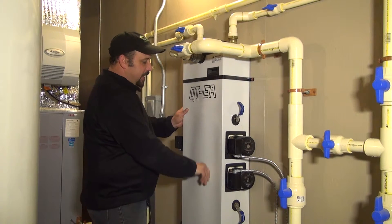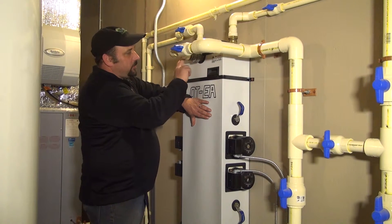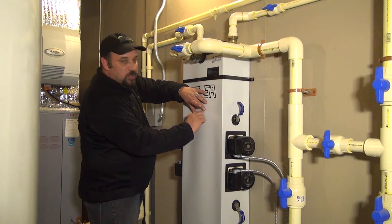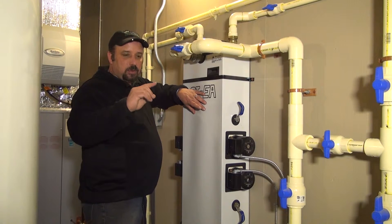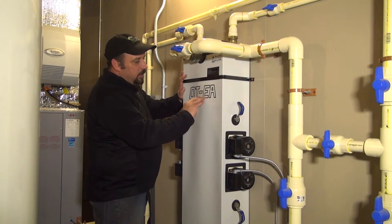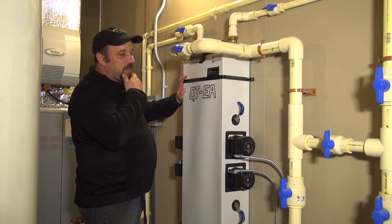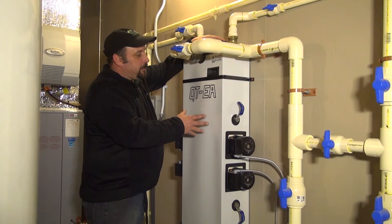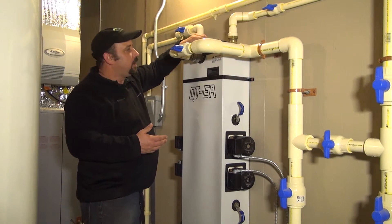In this particular system, there is a vessel tank. Inside, this tank is a reservoir of fluid. As your water enters the flow center from your outdoor loop, it has a dip tube that goes down into the reservoir, submerged in fluid — kind of like drinking from a cup with a straw. If you put your finger on top of the straw, you can pull it out and fluid stays inside. As long as the fluid level stays above the bottom of that dip tube, you won't get any air bound in these systems. If you do get a little air, they have self-bleeding caps on top that allow air to bleed out above about 10 to 12 psi, relieving expansion, contraction, and pressure.